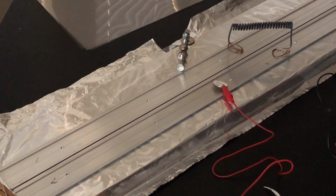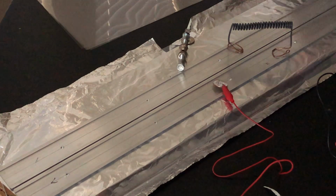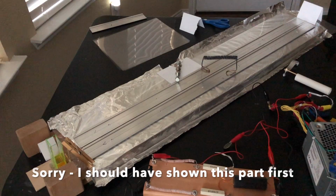But I've also noticed there's some sparks tracking across the dielectric. And no laser pulse occurs when that happens. That's the problem with widening the gap. Sparks jump around the spark gap. And remarkably, sometimes putting a piece of paper under there will keep that from happening. Why? I don't know. I guess because the paper is like a resistor. Okay, so we need to make some adjustments.